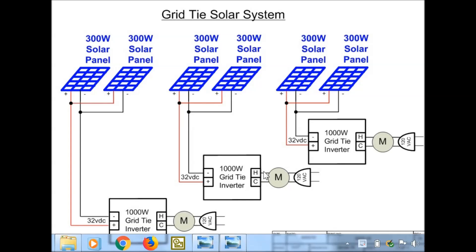On this one and also this one up here, I've got a relay circuit which disables them if the power is not being used. Another quick note: on these plugs right here, it's best if you plug these into outlets which are on different circuit breakers instead of having all three on the same circuit breaker. You can identify circuits by turning off breakers until you see the power turn off. It'd also be nice to plug them into different phases — you've got 240 coming into the house. Measure the hot of each circuit breaker: if it measures 240 between two breakers, they're on different phases; if it measures zero, they're on the same phase.